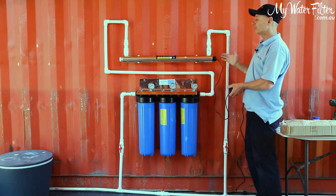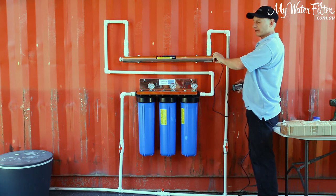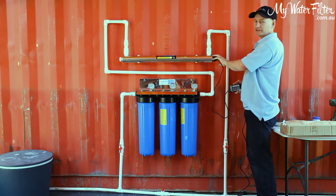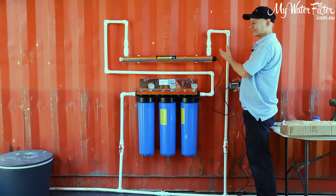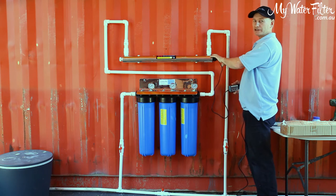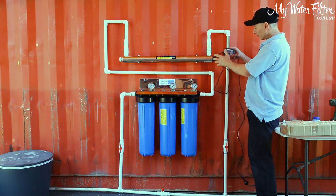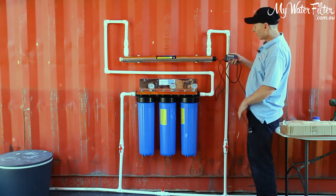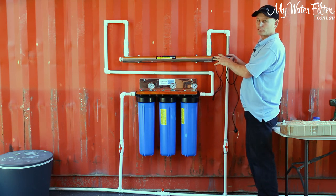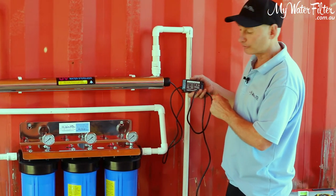Now, if you're going to have this outside, I just wouldn't leave it unexposed like that and expect this rubber to be protecting that from the rain, all right? Water gets into everything. So this needs to be sealed in some way, especially on this end, all right? You'd get away with it for the rest of it, but all of this electrical part here, you want to have that dry at all times, okay? Or else it'll just short something out. No joke about it, all right?